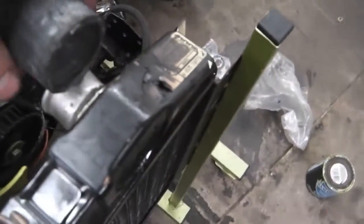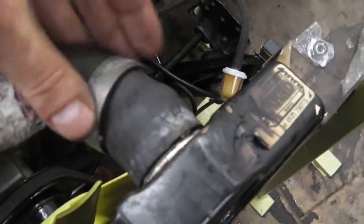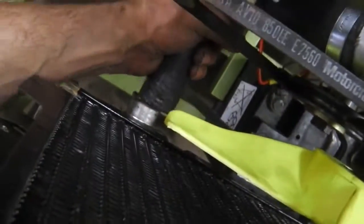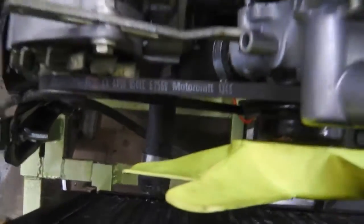I had to drill some pilot holes, and I'm using these self-tapper washer fixing screws, 8mm heads. So I've nipped them up, so we're not bolting it at the front anymore. It goes on the inside there, not a problem. And now you can see that rests perfectly over there like that, so we can slide that on now, and we're in and we're good to go there. We've even got Pink Floyd on at last, great. Right, so there we go, and then at the bottom, look how that fits in perfectly in line, so we're right there. We can slide on at the bottom. I've greased the inside of the hose, so we're on there too. There she goes. Right, so let's get the Jubilee clips fitted.